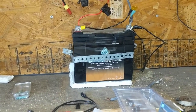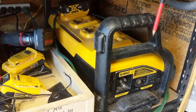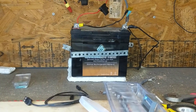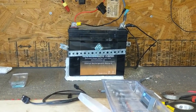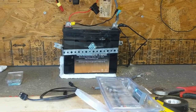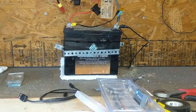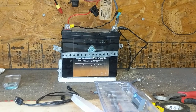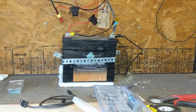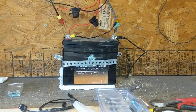You do need to think about that depending on what you're wanting to charge. Like if I hooked up my power bank here with four 5 amp hour batteries on it and we're charging all of them at the same time, this little battery here is not going to be able to handle that. I would need to hook up some more batteries to give it more charge capacity — basically a bunch of 12 volt batteries all hooked up so that I'd have, say, 70 plus amp hours. And you can do that. In my trailer, I rarely need to charge a battery — I've got quite a few in standby. But occasionally I'll need that one battery recharged, so this is one way you can do that.